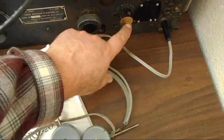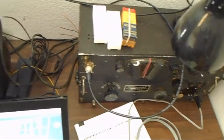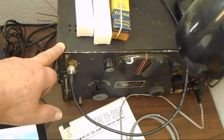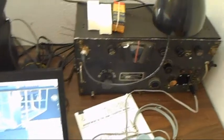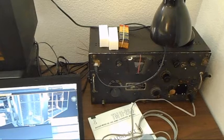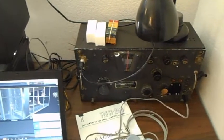Apparently somebody filled it in — I guess it must have been cracked or something. So I'm going to have to sand that and repaint it. And then I'm going to have to go ahead and use crinkle finish on the whole cabinet, because somebody sprayed it with flat paint and it's supposed to be a crinkle finish. I also have a speaker coming — it's an LS3 speaker that they used on these receivers. That's coming from Fair Radio Sales. I also just got some more tubes in today.